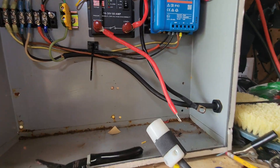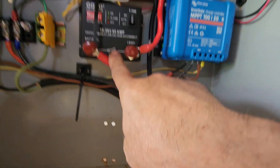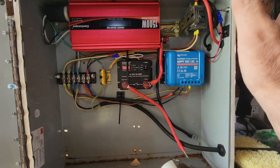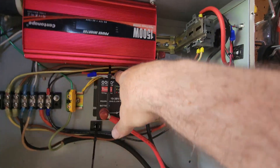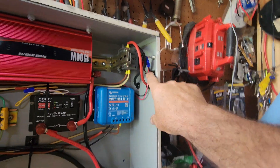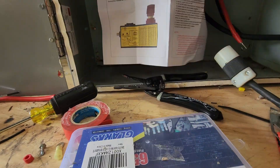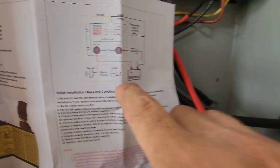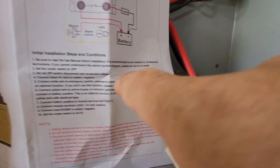The battery just needs to connect to the main terminal. This is the latching relay — not a shunt. When the voltage gets too low, 10 volts, it'll open up and cut power, and that was the problem I was having before. The indicator light is wired from the alarm output, so when the latch opens — voltage drops below 10 volts — that light goes on to let me know the battery is depleted.